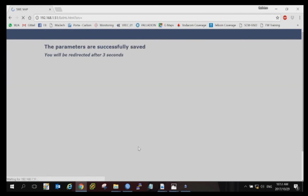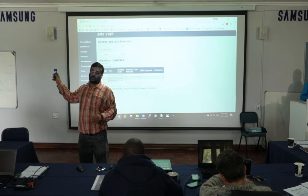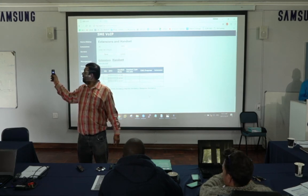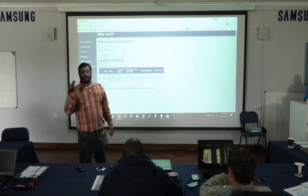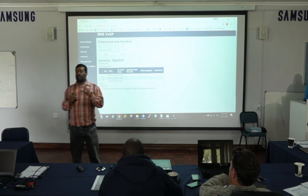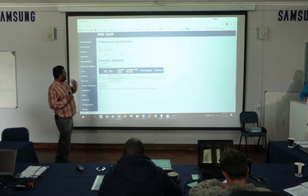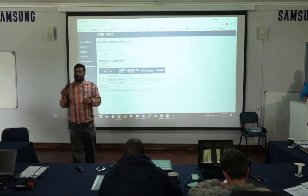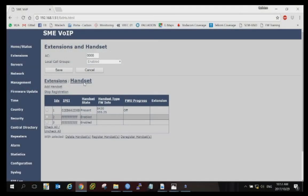As I said, menu, go to the little colorful circle there. It says connectivity. You press OK, and you press OK on register. The access code to register these to the base station is 4 zeros. Now take into account, it's not the same 4 zeros we set up with the SIP extension. It's totally different. So 4 zeros, 1, 2, 3, 4, and we go OK. It says registering on the phone.